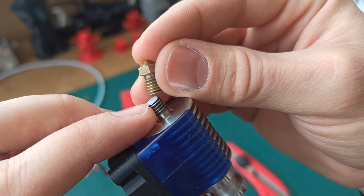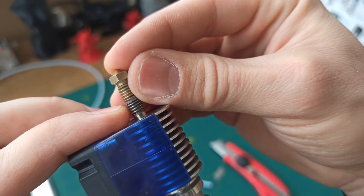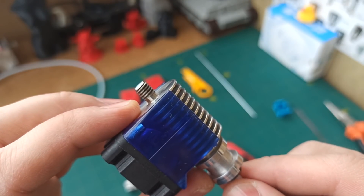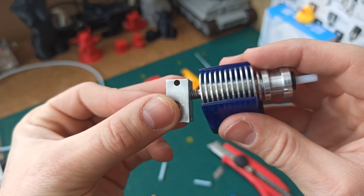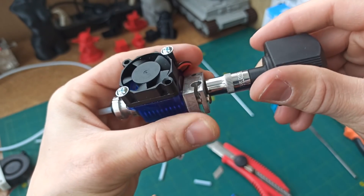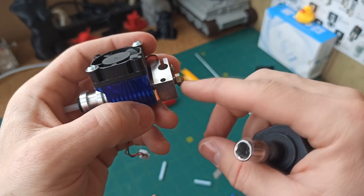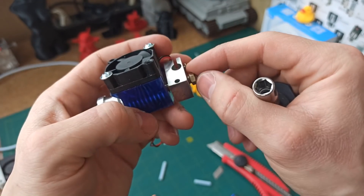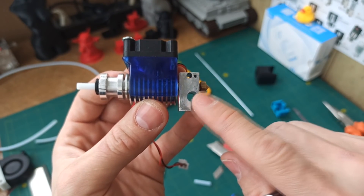To avoid this, the teflon tube must be under constant tension and well pressed against the nozzle, with no gaps — even after the heating process, during which teflon can also sag slightly. Therefore, a reserve of 0.2–0.3mm is mandatory. Now you can confidently screw on the heating block and tighten the nozzle firmly. When tightening the nozzle you'll feel it has bottomed out against the thermobarrier, but you'll still feel resistance as you tighten — that means the nozzle is pressing the teflon and eliminating all gaps. Now, friends, our hot-end is assembled correctly. No clogs, no jams can occur.